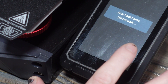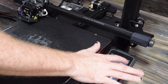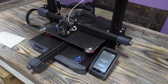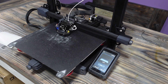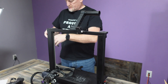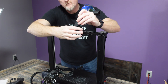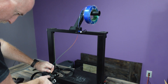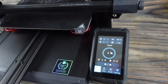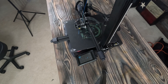Now we home the machine and let it do its thing. Here I'm doing a manual leveling of the machine — I'll link to a video on how to do that below. Then I let the machine auto-level itself, which might be overkill, but who cares. Pick the file, prepare the filament, hang it on the machine, pull it through the guide and feed it in. Then just hit play and let the machine start doing its job. It looks like it's printing great, doing its thing.